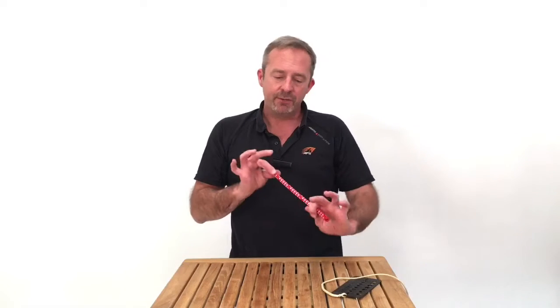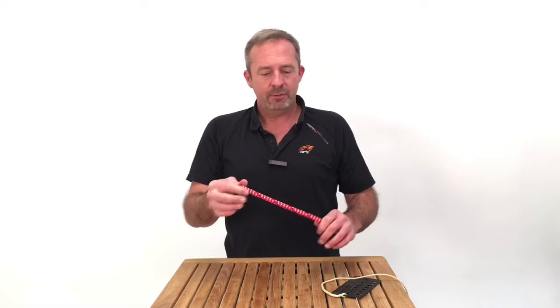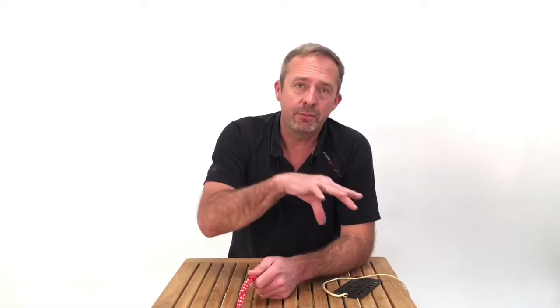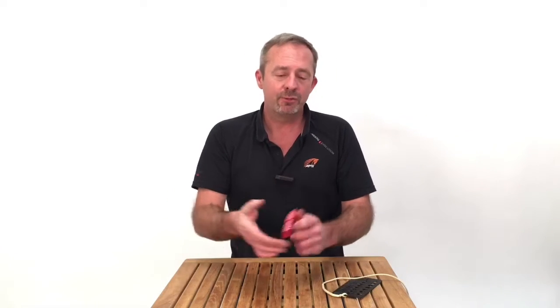If you can imagine, they've got a finished line coming off the braider, and they measure the diameter and it comes in at 11/32 inch. Well, 11/32 is not a diameter that we commonly use when talking about running rigging. So that's halfway between 3/8 and 5/16, and they're going to have to make a call. They're either going to round it up to 3/8, and in that instance, we would call it a skinny or thin 3/8 because it's not quite 3/8, or they round it down and call it a 5/16, and in that case, we commonly call that a fat 5/16. But it'll be specified as either a 3/8 or a 5/16. So, story is expect variation.